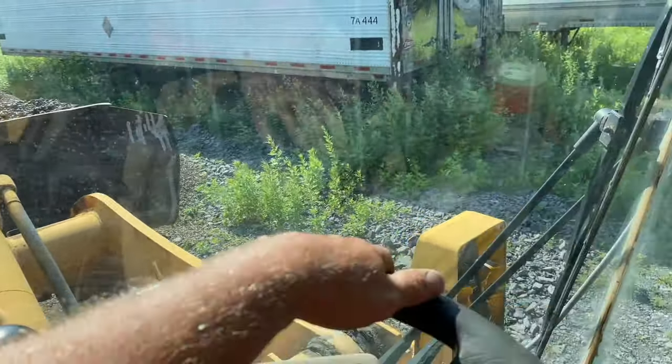That friggin' form is bowing too. I usually like to put a little dirt against these, but I didn't this time. But these guys are pulling this way so that we got 16 foot going this way. That's what they're doing now, so that screed's long enough. That's a 16 foot screed. Plus we're also freshening this concrete edge right here. Biscuit's like walking the new concrete into the old concrete. Kind of blends it together. It's in good shape though.